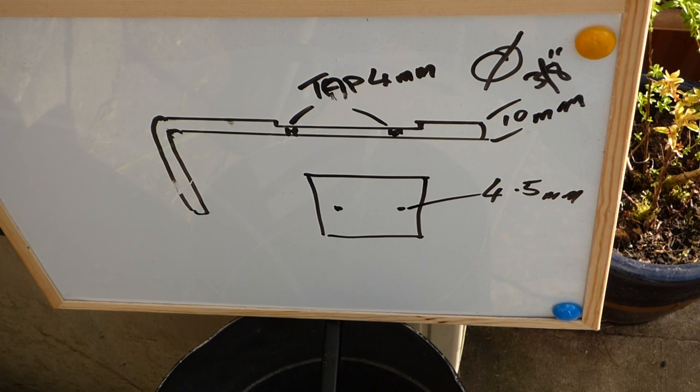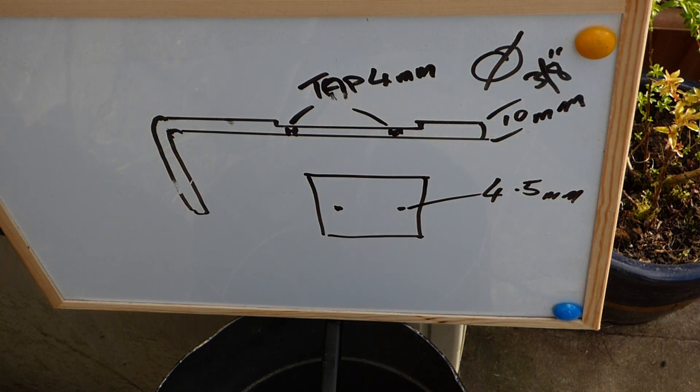That gives you how I made the butterfly valve. It's just bolted on with two 4mm Allen screws. The 10mm bar is drilled and tapped. The piece is ground away out of the middle, or machined - in my case I just put it on the mill and milled out 3mm depth to give me enough room for the screws to go in.